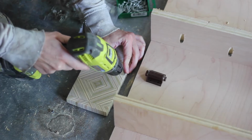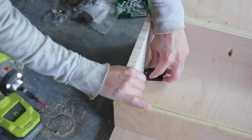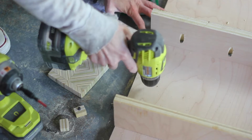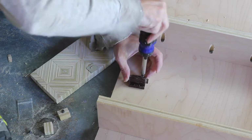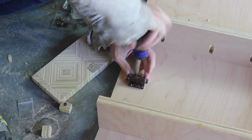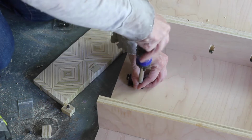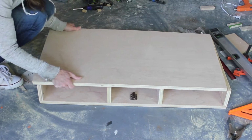I wanted to attach the panels with magnets like I did for my son's desk, which I will link in the description, but I didn't have the same kind of magnet, so I used these magnetic touch latches instead. I centered the little metal plate at the top of my panel, well it will be the top when we flip everything over, and I attached the touch latch to the center of the table, making sure to line it up so the panel is flush with the edge when the latch is pushed in. I marked and drilled a few pilot holes, then screwed the latch on, and then I just repeated the same process on the other side.